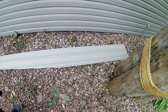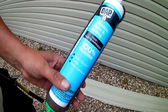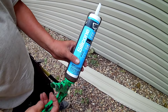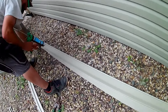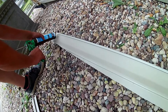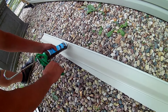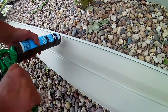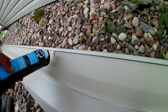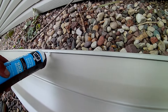So what we're going to do is flip it over — we do have some nailing flange here — but what we have here is 100% silicone, and this stuff works really good. I just take it and put a nice big fat bead in there. You can see how I'm doing it, and we're going to go all the way across. I promise you, once this stuff dries, this thing is not going to come off.